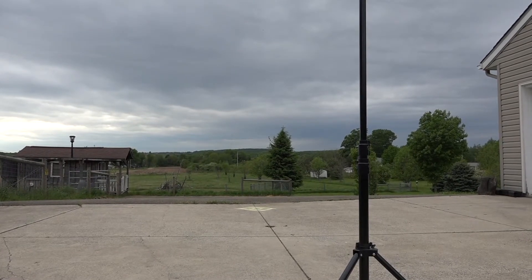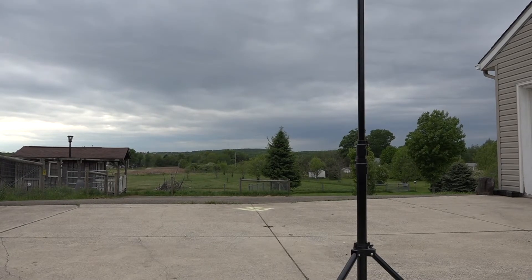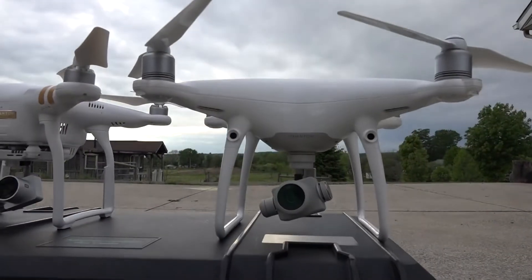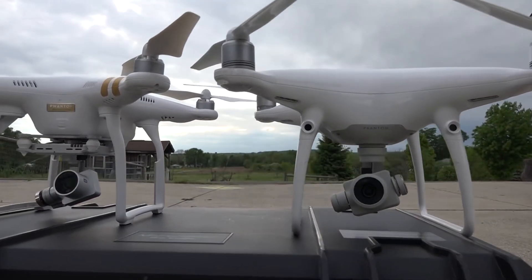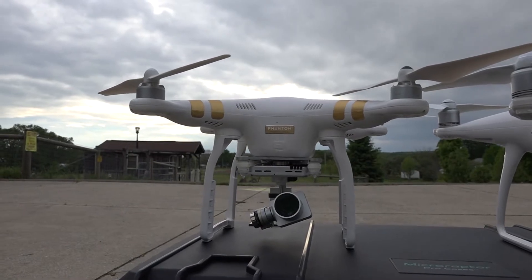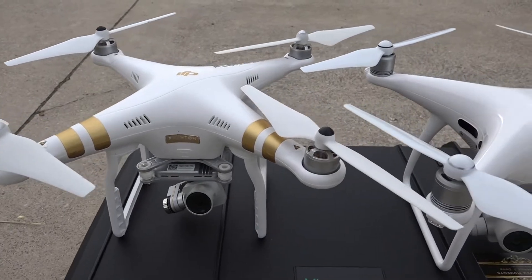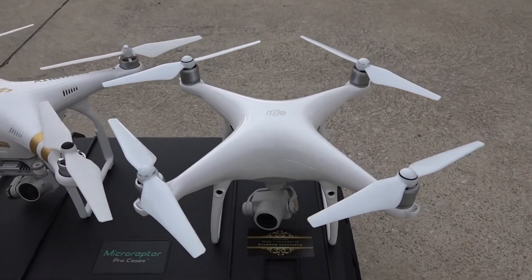Today I'm going to answer a question I've been getting frequently. When I did my test in comparison with the P3 Pro Phantom quad, I did a hover test and there was a lot of discussion between the graphite black props you can buy from DJI and the stock white plastic props. Today we're going to actually do decibel recordings with a meter. I'm going to do three comparisons: one with the P3 Professional with the white stock props, hovered at exactly five to six feet, 16 feet from our decibel meter, with the meter at a height of 61.5 inches.